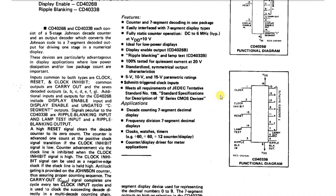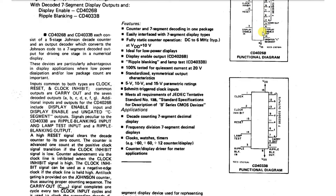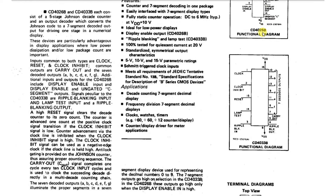I'll just scroll down to the diagram of the 4033. Previously we had discussed the 4026 version of this chip. The two are somewhat interchangeable - the pinouts are very similar. Now for the 4033, its main feature is that it has ripple blanking, so we'll talk about that.